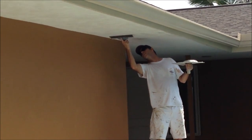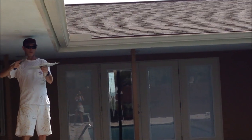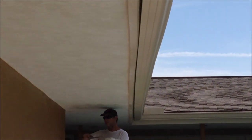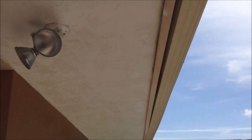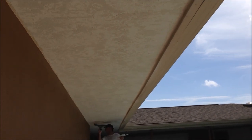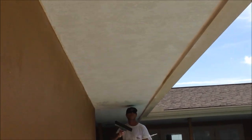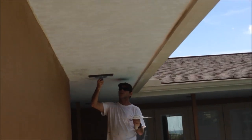I also add sand to the skip trowel to give it the skip. I do have other videos for skip trowel — I'll leave a couple of those in the YouTube card above. Here's where I've already skip troweled; it's a Mediterranean look. It goes perfect with the stucco at this oceanfront beach home in Florida. As you can see, the skip trowel texturing goes really fast and the hideability for skip trowel texture is awesome.